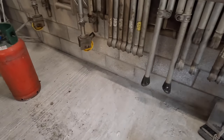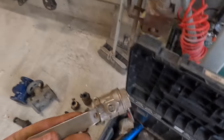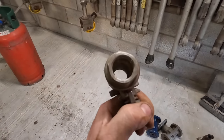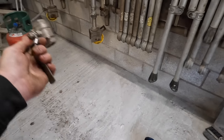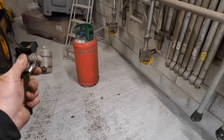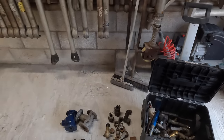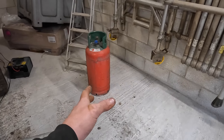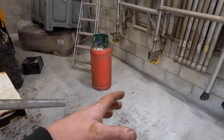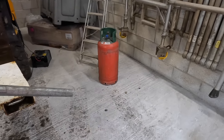I've seen people build these before, and I know for a fact you're not going to get, say, a ball valve like this to last. Yeah, you're going to be able to meter your sand. You'll be able to close it up to slow your sand down. Or your media, don't use sand, because sand's illegal in the UK. You want to be using approved media, crushed glass, silica free. Those ball valves will wear away metering media. They'll wear away just by the sheer volume of media that keeps coming through it and dropping through.